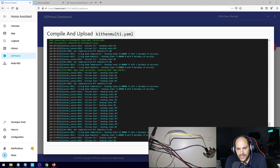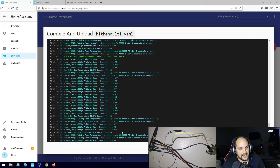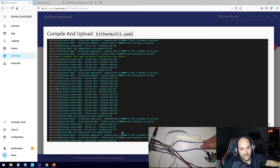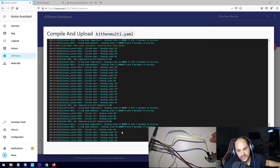Okay so that's it guys — we have them set up right here. As soon as I make some movement you'll see it change states in the log file. I'm going to make some movement right in front of the PIR sensor — there we go, as you can see it changed state as soon as movement was detected. I may need to adjust the sensitivity using the dials, but it does in fact change state. Same with the reed switch — let's quickly test that out. As soon as I bring the reed switch into contact with that magnet, you'll see the kitchen door change state to off, and if I remove it, it opens back up again.